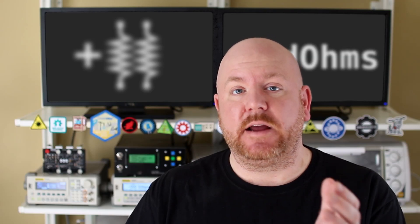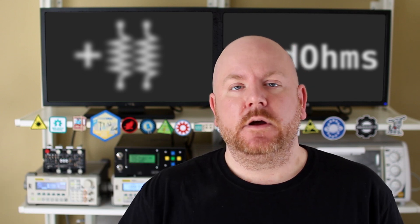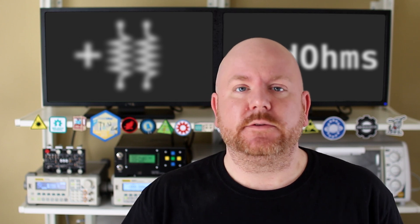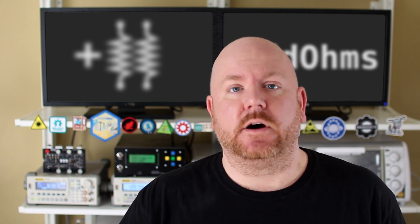When powering a circuit, you need a stable power supply. With the popularity of USB, 5 volts has become pretty standard. But what if you need 12 volts or 3.3 volts? Then you can use a voltage regulator. These devices take a voltage in on one side and output a different voltage on the other side.